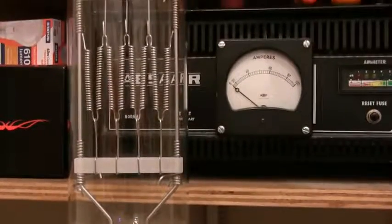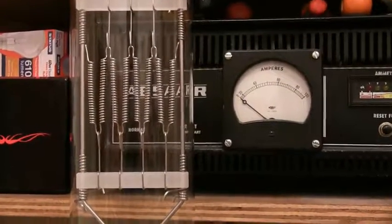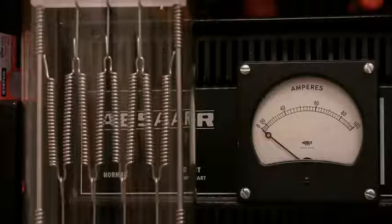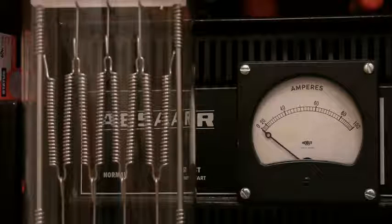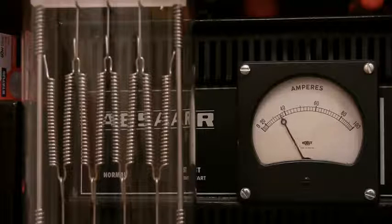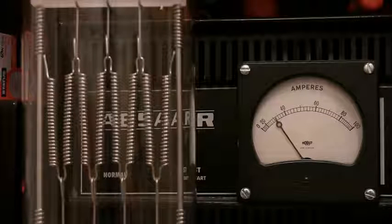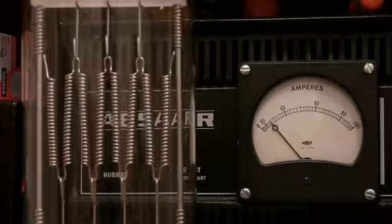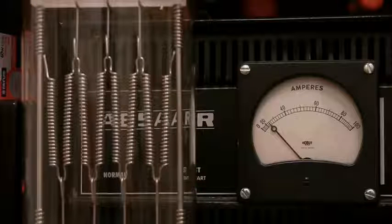This lamp is now connected to a 12 volt battery charger and we're going to observe something very interesting with the filament. A typical characteristic of these incandescent lamps is that when the filament is cold it will take on loads and loads of amps, and it's only when they begin to glow red slightly that the resistance increases and the current becomes more normal. It's dropping down — a little rattled now, you can hear that.